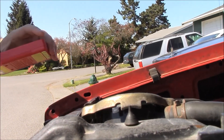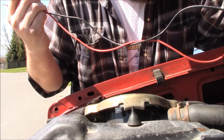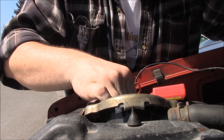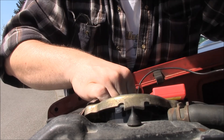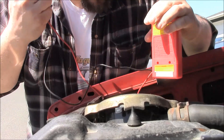The multi-meter has juice — it's on the 20 volt DC setting. Let's see what we can get here. After all the charging I've done on it, it's not swelling on the sides at all. I bought it about a year and a half to two years ago — November 2013. The reading is fluctuating a lot: 7, 8, 6, 7, 4, 6, 5 — it's actually dropping.